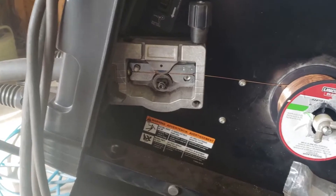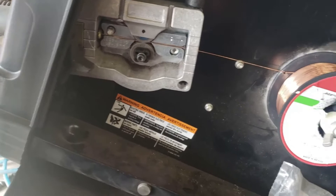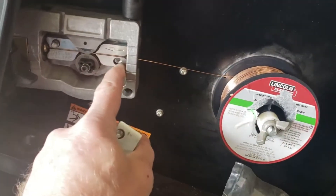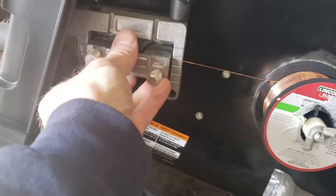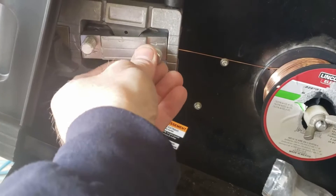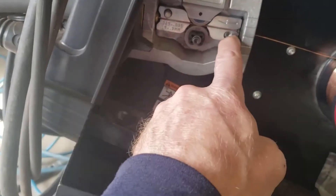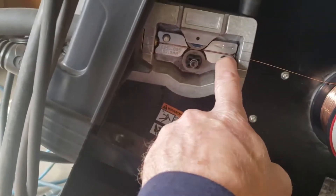I seem to get more birds nesting than I should, and I'm sure it's mostly my fault — settings and all that stuff. But because of that, you get a little bird's nest in here. This piece is screwed on with little aluminum threads, and even taking it off you'd notice the threads were starting to go bad — almost like it's cross-threaded but it's not. This one started going bad, I could hardly screw it in and out, so I tried to put a little tap in there and just broke it off.